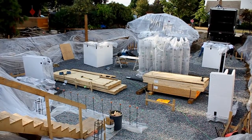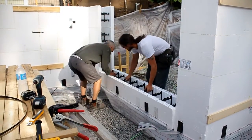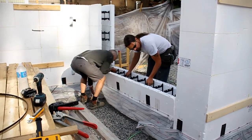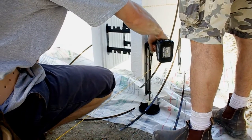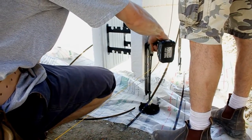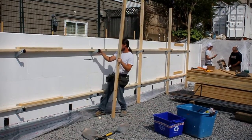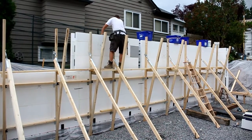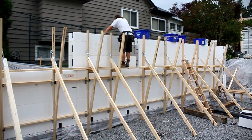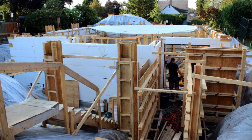The steps are: the truck arrives and drops the modules off, and we assemble them. They have a bag footing with adjuster feet on the bottom. You just put your drill into them and adjust to height with your laser level. It went in very quickly and easily. We install the Zonts onto the walls — that's their proprietary bracing system. And we do a final check for level, do some minor adjustment, and then we pour.